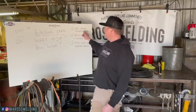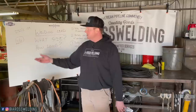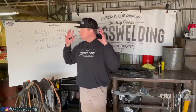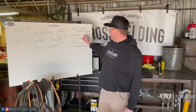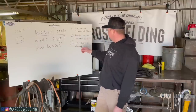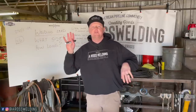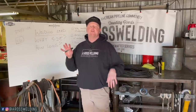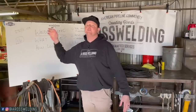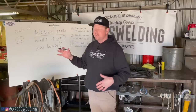There are three different things to consider when picking out welding lead. One is total length of welding circuit — that essentially means your total amount of welding lead; in my case, 250 foot is my total circuit. Number two is rated output of whatever welding machine you have. And number three is duty cycle of the welding machine. I'm going to throw up a couple of pictures and charts here so you can see how I found out that my 1-0 lead was slightly too small for the length of welding circuit I have.